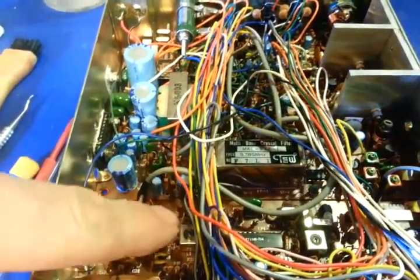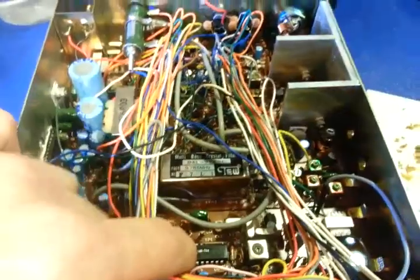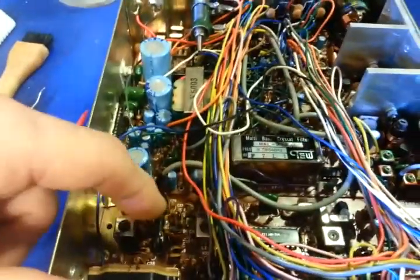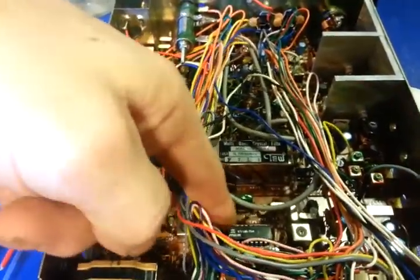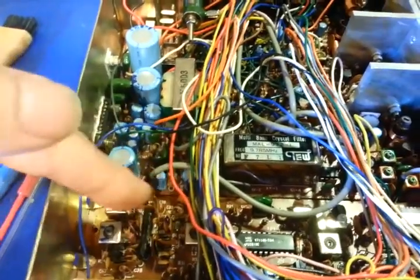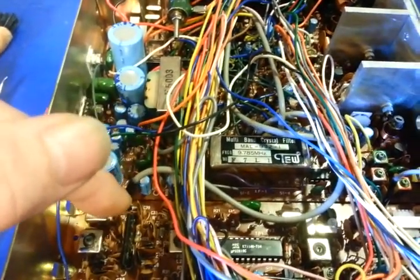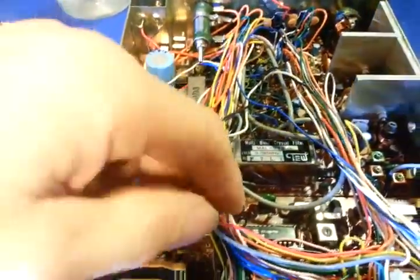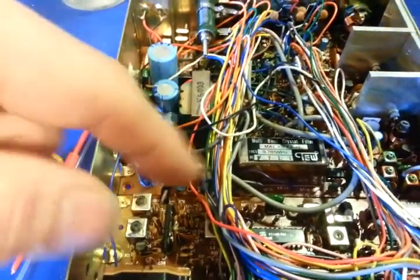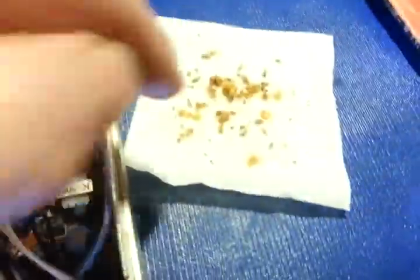A lot of times what I'll do — and it's what I did on this one — is remove this IC, because that glue gets in between each of the terminals on the IC and you'll never get it out with the chip still in there. Cobra 2000s and a lot of the other Cobra GTL model radios were known for that — they'd pour that goop on the backside, and the PLL chip would be located right about here. The VCO circuit's right there, and they'd pour goop on capacitors and other components, and it always oozed over and would touch the rear left corner pins on the IC chip. Lord only knows how many PLL IC chips I've had to change in Cobra 2000s because the pins were literally corroded off — the radio came in not working because some pins were literally gone, eaten off by that goop as it became corrosive.